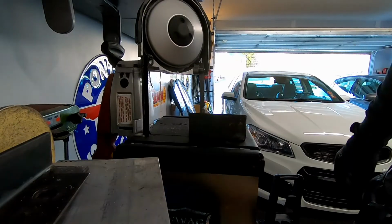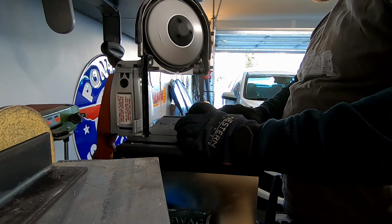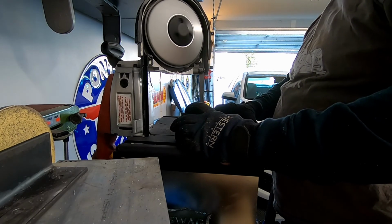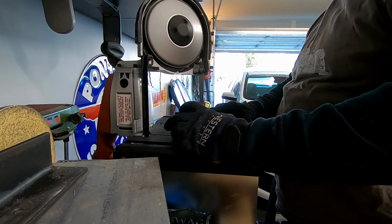The muffler says it's supposed to cut it down by 30 decibels. I doubt we'll get that much, but if we can reduce it by anything, I'd be happy with that, because I seriously hate how loud this air compressor is. To mount the muffler and the air filter to the air compressor inlet, you can see that we're cutting the angle iron. We're going to cut out a flat piece and bolt that to the air compressor intake.